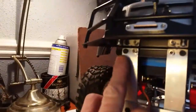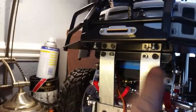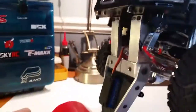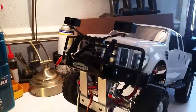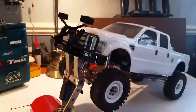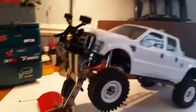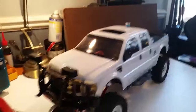There's an easy way to mount it — I did have to drill and tap two holes here just to add a little strength, but it's holding up very well. It's a D90 frame, and I love those frames because there are holes drilled in them everywhere and they're highly customizable.